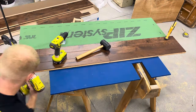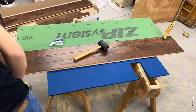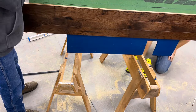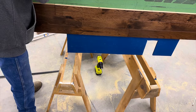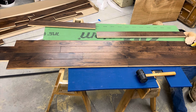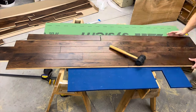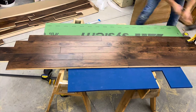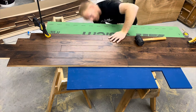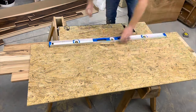I didn't use any wood glue. The reason is I wasn't sure if I would ever want to reuse this hardwood flooring for a different project in the future, so I just put in a lot of screws. If you want to use glue, there is one section on this project where you cannot use wood glue if you are following my exact steps — you'll see that later. I'm continuing to attach the next rows of flooring, repeating the same process underneath — drilling pilot holes into the plywood and hardwood flooring, being careful not to drill too deep. As I attach more rows, I'm keeping one side all lined up straight with a two-inch overlap, so I have a reference edge and only have to cut off excess on one side.